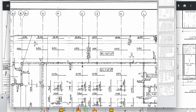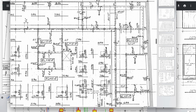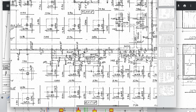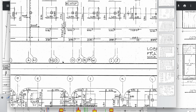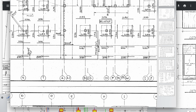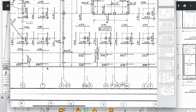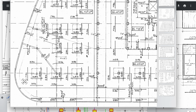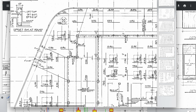Up here, outside wall, right up to the building, extra steel. So I believe the intent of this was kind of sneaky. Some engineers believe it goes everywhere. I believe it's very clear that they wanted extra steel here. Thinking as a contractor, you're not going to give extra everywhere. You're going to say, "Yo, man, your notes make it clear, and you also identify a location for those notes in the plans." And it appears to go up to the first column, which would be the outside edge of the building at that location, on the two ends.